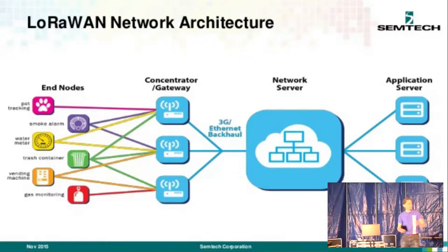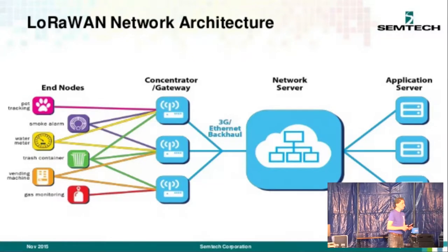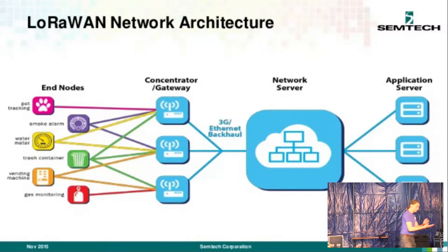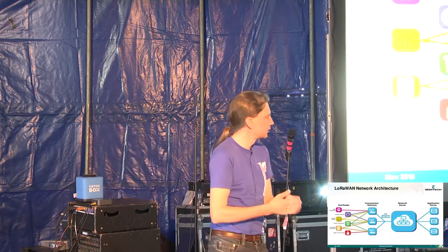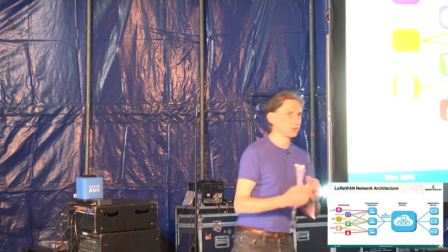Right, so that's the reason why we've got the two keys, although it's just more things to type in. But you need to activate, you need to get onto the network. You can do it the old way, where you put in your device identifier, which comes from the application. This is just a short number that will say the number of your device. It's not unique, but it's unique at that point in time. And you have two keys for the encryption, and a counter, which starts at 0. And this is to stop what's called a replay attack.